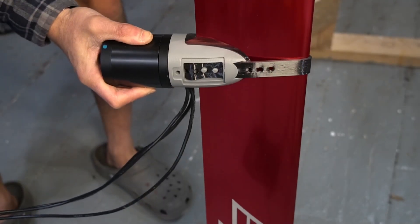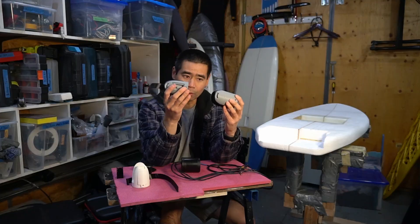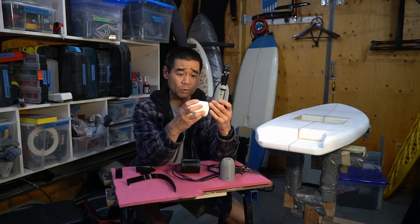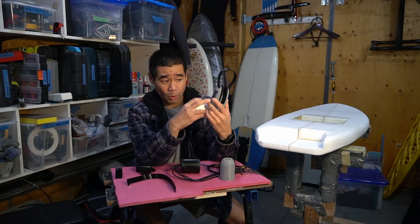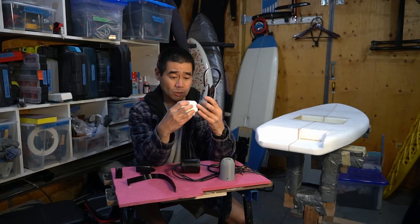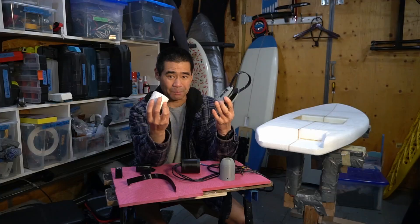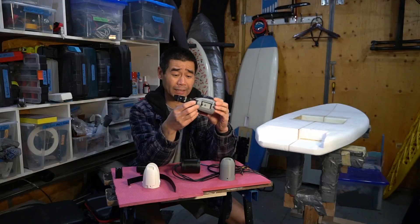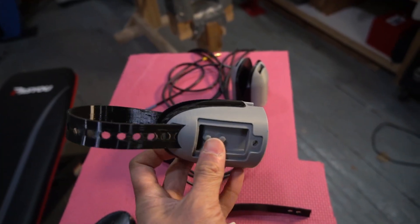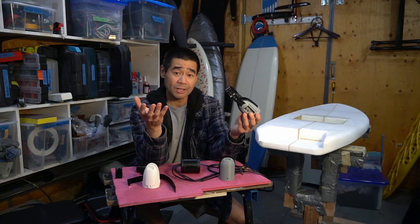That's the pod. I went through another iteration that was a little bigger, but after some testing I found this smaller one works better without excess material. There's also a door with a 3mm heat insert, and you can use a screw to hold the hatch on — I personally just use some tape, but it's up to you. Maybe you'll find this design useful for whatever foil assist or e-foil you're DIYing. See you guys in the next one.